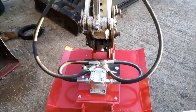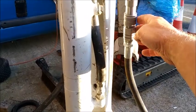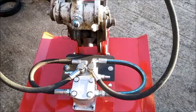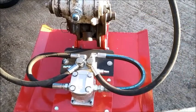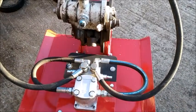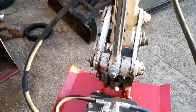The hydraulic installation. Here we have the high pressure input running down to the pressure relief valve block. From there it goes straight round into the motor inlet, and from the motor outlet back into the pressure relief valve block before going back onto the return pipe.